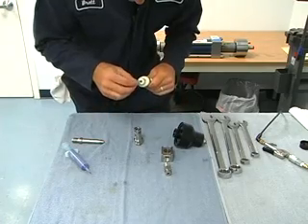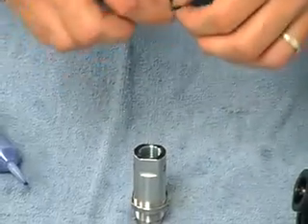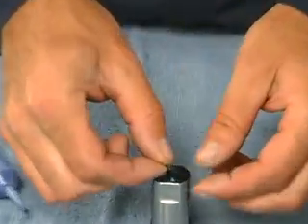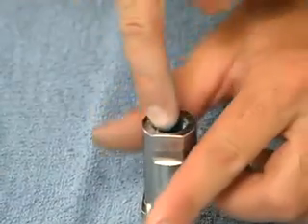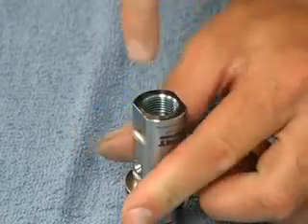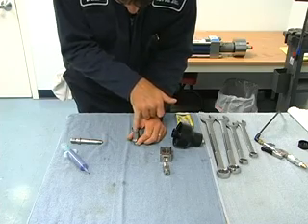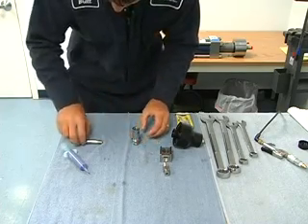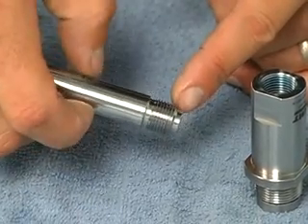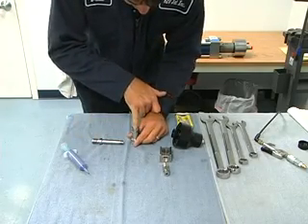Next, we have the o-ring that goes in this side. This o-ring doesn't do any sealing for us — it's just to hold the landing in there. If we're changing nozzles out over the cutting table, it holds the poppet in there so it doesn't fall into the water on you. Parker Lube is important on this o-ring. If we put it in dry, it has a tendency to hang up on the end of the nozzle body and roll up underneath where we need our sealing surface, and then it leaks. Make sure our o-ring is down in there.